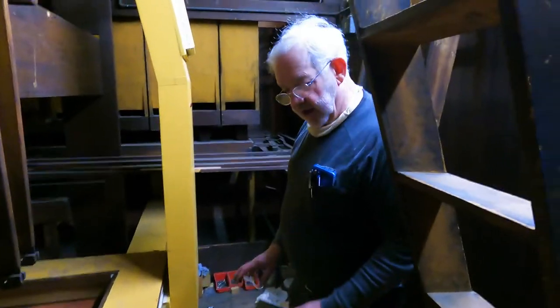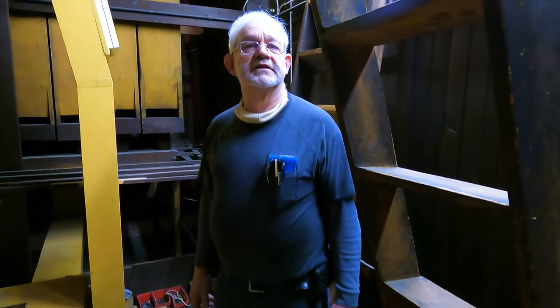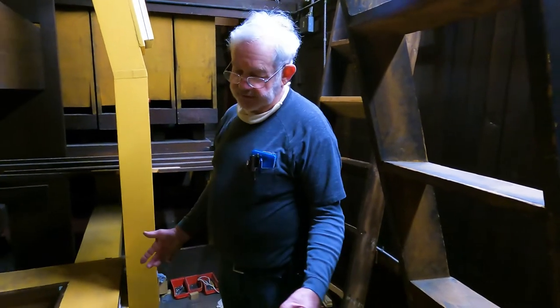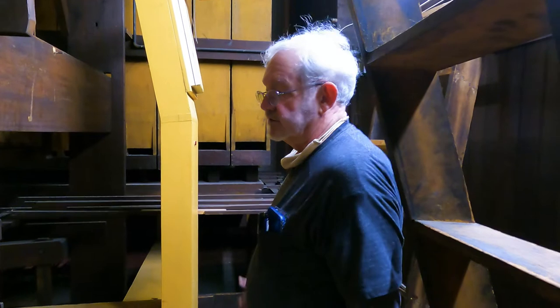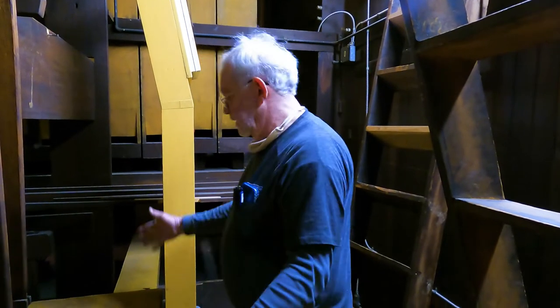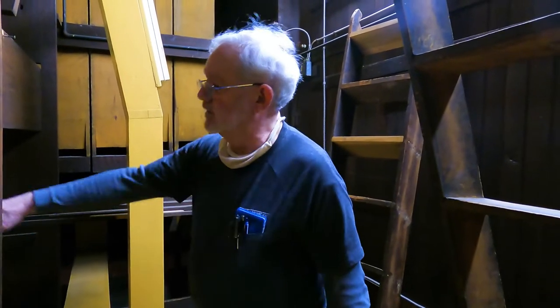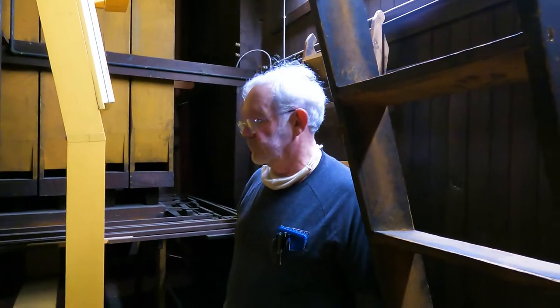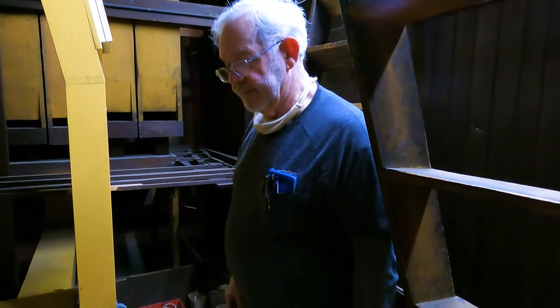Gotcha. But it seems odd that they would have a fairly light box and such a massive top, unless they planned that to be part of the weight that they needed to make. Oh, I didn't think about that. That's a good idea. That's the only other thing I can think of that would make it so heavy. Yeah. And because normally a reservoir of this size at 3 inches of pressure would have been completely covered with bricks in a single layer. Of course, they were piled on the ends, but the ribs we found inside to straighten the top transfer any of the excess weight on the ends to the middle because it's attached. Right. And so we don't have to really be concerned with spreading out the weight evenly over the top because of those ribs, those stiffeners that are in there. But it's interesting. You never know what you're going to find.